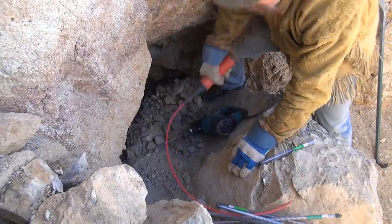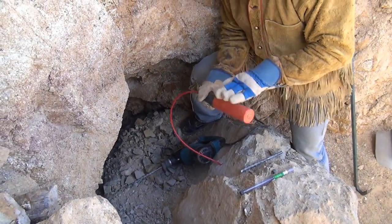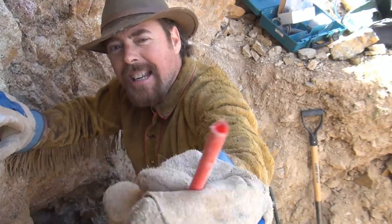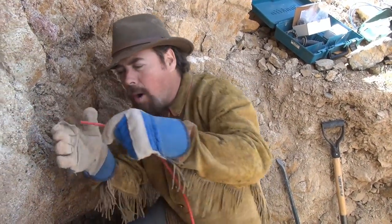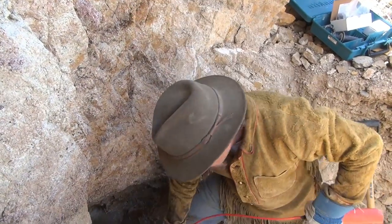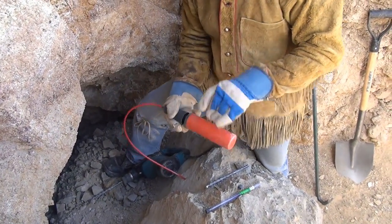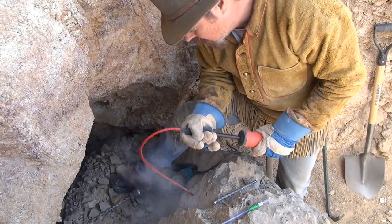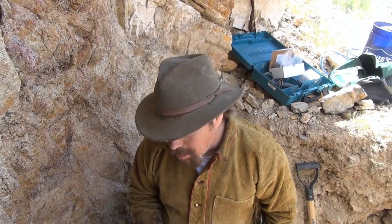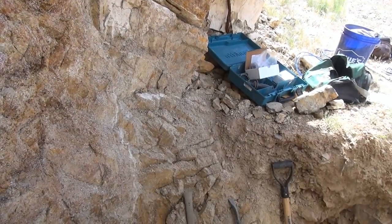I've got this hole ready. Now, one more thing — I've seen a lot of guys just shove the pump all the way down in the hole and crank on it; you'll break this pump. First thing when you buy this pump: notch the end of the tip. The reason is that when it's all the way into the back of the hole with no notch, cranking down could pop the seal. With a notch, air can blow out to the side. Put it in gently, back it off a little, and pump slowly. Too much pressure can pop the top or rupture the seal. So remember: notch the tip and be nice and gentle.